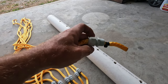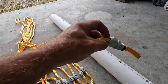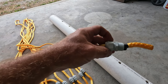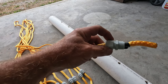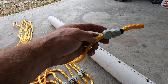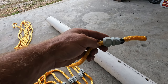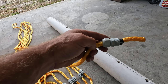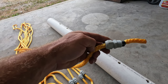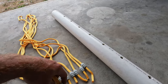The zip ties still allow the insecticide mixture to wick down through the tube. When you tighten the cap on the fitting, it squeezes the rope tightly — that's how you throttle or control how much material flows through. When you first set it up, set all fittings to the same tension and then adjust to find the best flow rate.